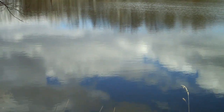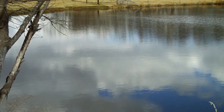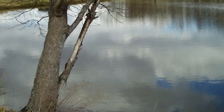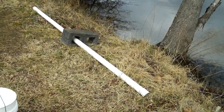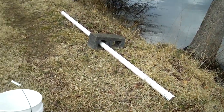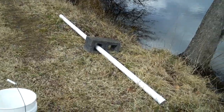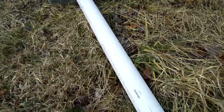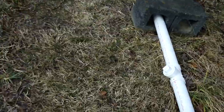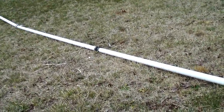With no gasoline-powered pump, I'm going to show you that if you don't have a transfer pump or a trash pump, you can use a siphon pipe. That involves some pipe — I'm using two-inch PVC, about 50 feet of it. I'm using some 22-degree fittings on the ends and also a small cleanout. I'm using the cleanout to fill the pipe. If you want it to flex, you'll want to get some Ferncos, which are the rubber fittings with the bands.